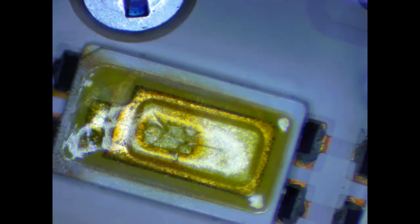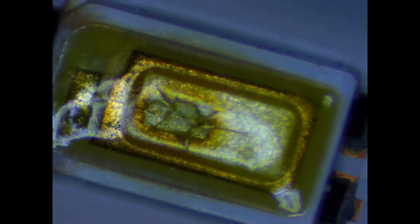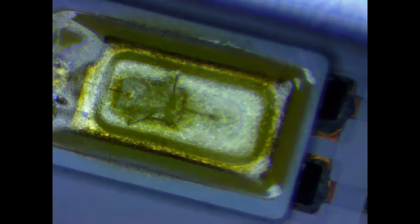Here under the microscope we can see that the LEDs have all overheated. Many of them are brownish or have a cracked surface. So now we can either remove the whole strip, just remove the defective LEDs, or replace all LEDs — that's up to you.